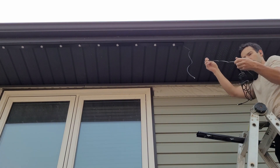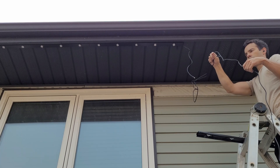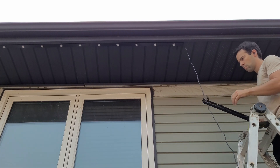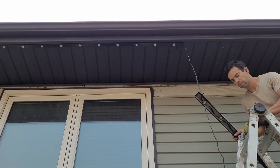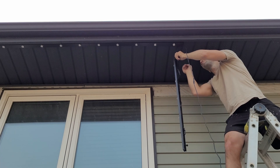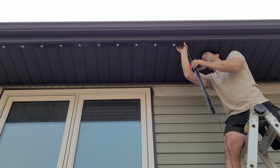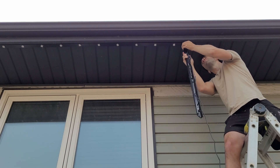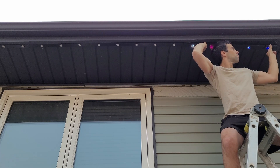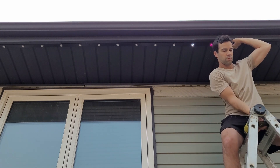So I've ran my first 20 feet from the controller. Those power injection cables are 20 feet, so you could inject here, but really you don't need to — you can go every 40 feet. I just added another 20-foot extension on there and I'll just keep running. When I get to the 40-foot mark — which is 20 and 20 — we'll show you how to hook the power injection into the lights at that 40-foot mark. You can just run it right through and push it up with the track; it doesn't make the install any more difficult having that power injection cable there.